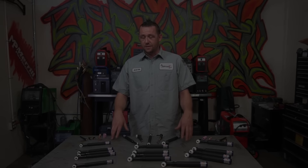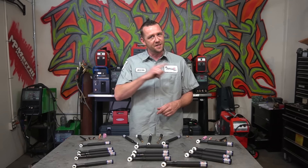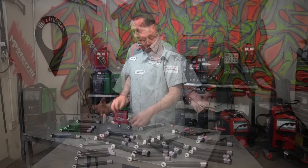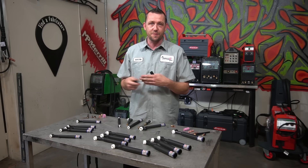The torch type, torch family, and amperage rating associated with each family end type is the most difficult thing to figure out — it's kind of like a foreign language. But we still have the variants. A variant is an option, and they're typically just a few mix-and-match combinations. The first one is our rigid torch. Rigid means it's stationary — it doesn't flex, doesn't move, doesn't have a valve, has no attachments. It's only a single line in, or three lines if you have a water-cooled setup. They're available in every single family and are basically the standard, simple baseline torch.